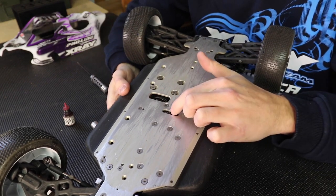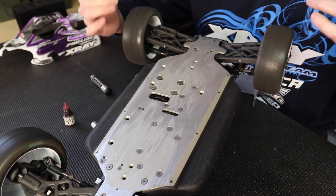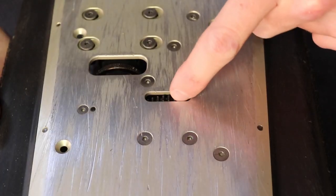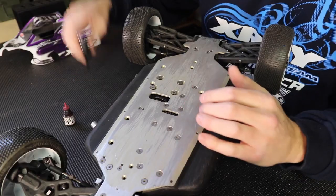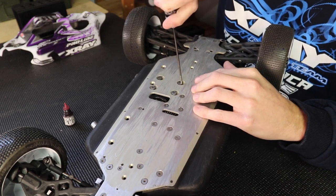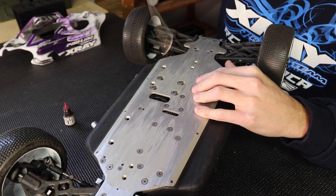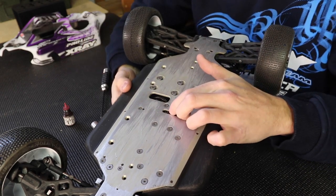Go under and feel it again — there's a knock there, hear that? It's a lot quieter now, you can roll it and it doesn't make much sound. It has a little bit of a knock. Then go ahead and tighten them up — be careful not to move it. Go through all four screws and snug them up just enough to hold it still while you go to Loctite everything.